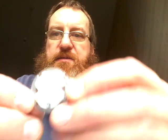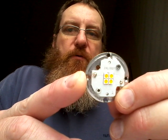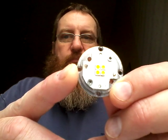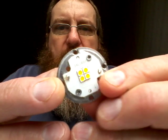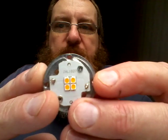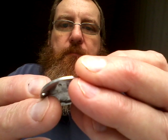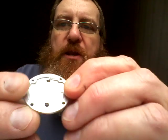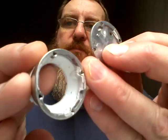The housing has a neat LED array. As seems quite common these days, they tend to go with either half watt or one watt rated LEDs and use a cluster of them according to the wattage. This is a really smart arrangement — it's the aluminium core PCB with four LEDs, mounted onto a sub-aluminium assembly with heat sink compound.